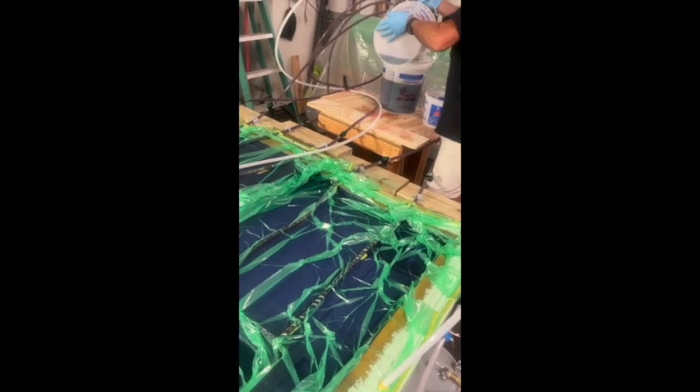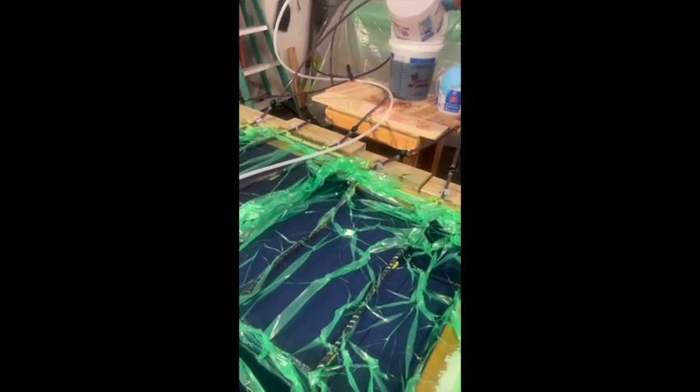Dennis will keep that resin bucket full so we don't get any air bubbles in the lines. You see on the edge here, you can see it creeping in — this is resin creeping in right here towards the vacuum line, which is right here. So now what we've got is the resin front almost complete all the way around, up to the vacuum line.